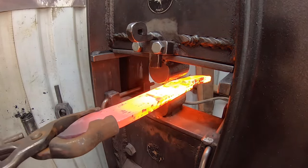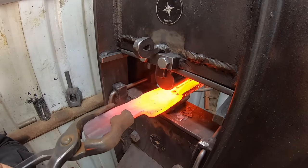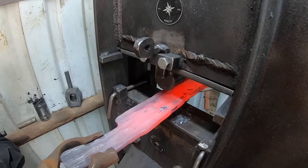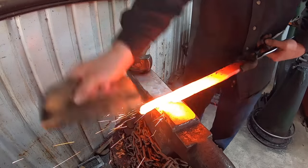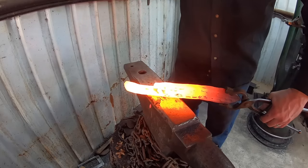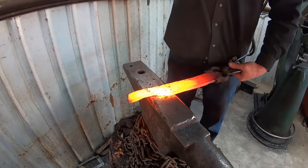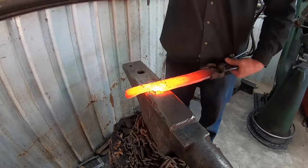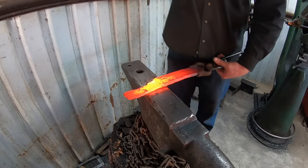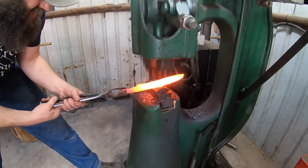This billet needs to be wider, and we've got things forged in for the handle and tang, but we need to widen everything out — that was part of the plan from the beginning. Using the forging press with round dies is pretty effective to spread that out into a nice wide chopping blade. This is where I had to come back and incorporate some more material into the tang, and I had to touch that up with the angle grinder just a tad to avoid a little mechanical inclusion starting to form. I miscalculated the amount of material needed for the handle, but that's the great thing about forging — until you've finished, there's a lot of leeway.